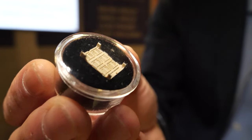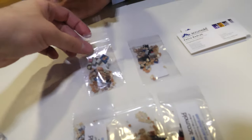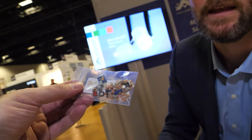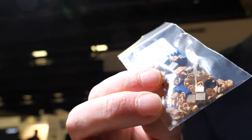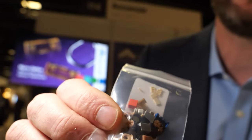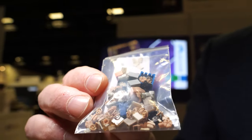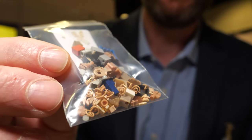Today this is a much smaller device, but it kind of shows some of the experience we've had over the years. So this is a lot of small things. At AccuMold we deal mostly with thermoplastics. They range from very highly engineered materials like PEI, a polyether imide, to PEEK, a polyether ether ketone — but there are thousands of thermoplastics on the market and we deal with some of the most sophisticated engineered resins.